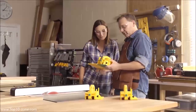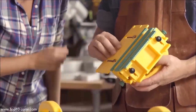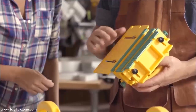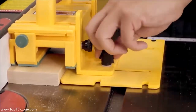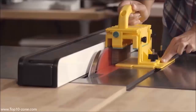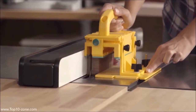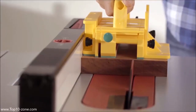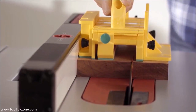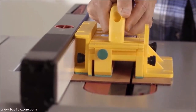We've also introduced Gripper Advanced, which comes with two additional precision accessories. The stabilizing plate gives you 250% more stabilizing area and locks the workpiece against the fence to enhance the versatility of the gripper. It intelligently maintains even pressure without binding to create safer and virtually burn-free cuts. The adjustable spacer adds 1 inch of additional gripping surface to tackle larger material and wider cuts.